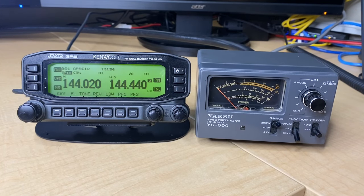My SWR is not doing great, but if you remember from earlier in the video, it's not 3 to 1. So what I would do to combat this is use this radio throughout the winter on a lower power setting. For me, using this primarily for local repeaters, operating on low or medium power really isn't a big deal — I can do that and have no problems getting into local repeaters. That's probably what I'll do throughout the wintertime to just limp it along until the snow goes away. Then I'll get back up on the roof, take it down, make my adjustments, and get it back up in the air properly — this time testing SWR before I put it back up, because I have a very steep and very high roof and it's not a fun time to get on top of it.